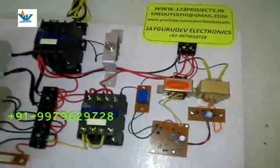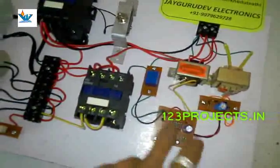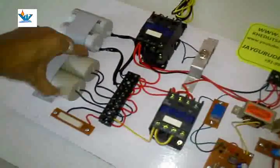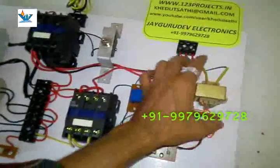Then this resistor will be connected and it will discharge these two starting capacitors, so there is no possibility of electric shock after switching off the project. During running, if this circuit detects fluctuation or low power at the output phase generation, it will again switch on the contactor and reconnect the starting capacitors for more power generation — connecting them until full power is generated.